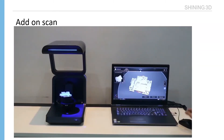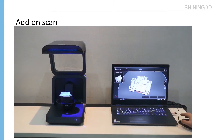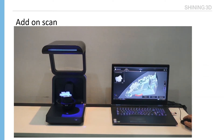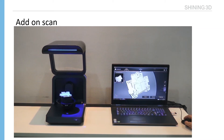Add-on Scan: Auto Scan has several scanning path settings. After scanning, there may be some area data not captured. Add-on Scan is designed to capture missing area data. Like a small and complicated shape, after scanning it will have some areas not captured. We can rotate, find the missing area, and just click Add-on Scan — the scanner will scan it automatically. We may need several add-on scans; just repeat the process to find the angle and click Add-on Scan.